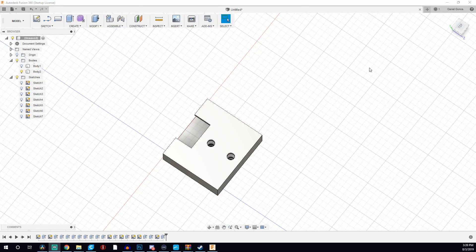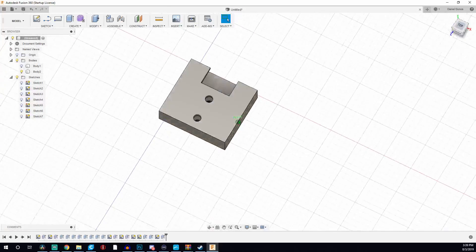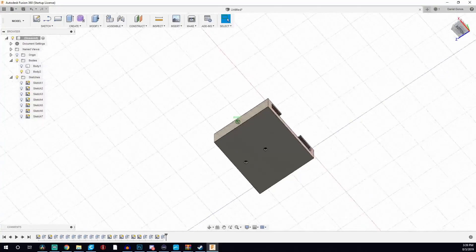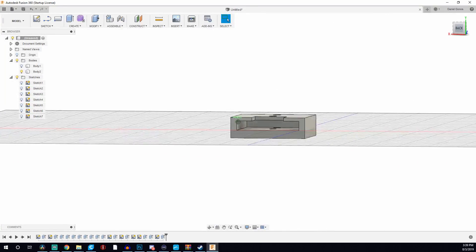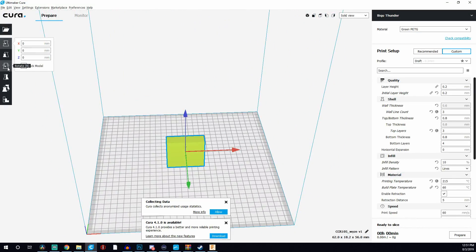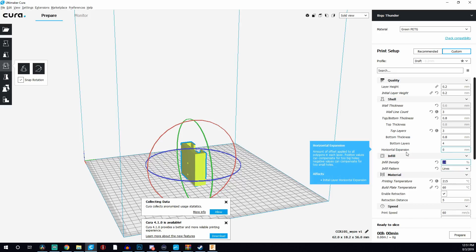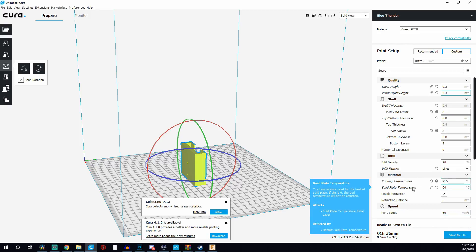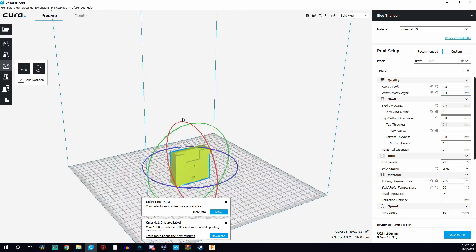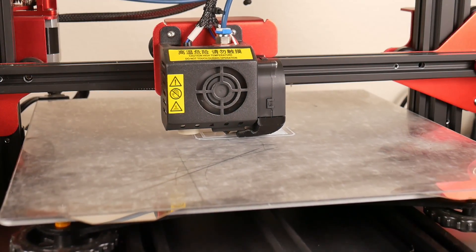This is what the final bracket looks like. It's got a little slot and two holes. The top holes are bigger than the bottom holes so the head of the screw can pass through and you can use a drill to get in there, but on the back side the holes are only about three millimeters so the head cannot slip through. I created little insert slots, and the cameras are light enough that a tight pressure fit keeps them in place. Once the model looked good, I exported it into Cura, sliced it with 20% infill and 0.3 millimeter layer resolution. I printed it in white PLA on the CR-10S Pro, matching the camera's clean aesthetic.